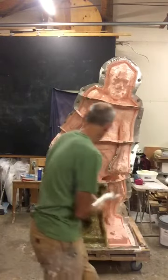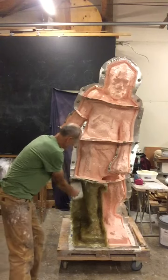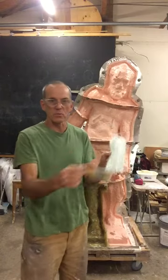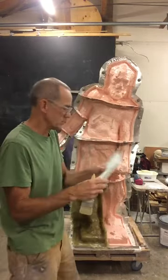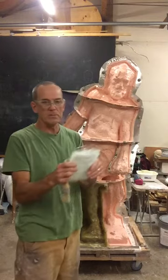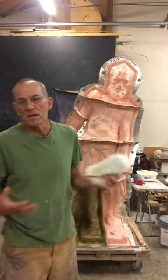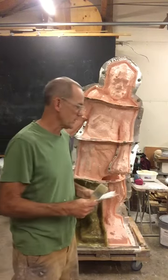With the brush, starting from the outside and working my way in, I'll push it onto the surface — push the brush into the middle and sort of work my way out, working the air bubbles out of each cloth grouping. With the paste and then the three-ply, I feel like that's going to give me enough thickness for the mother mold to work just fine.